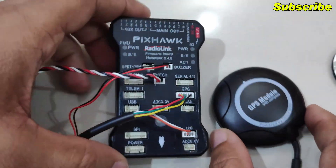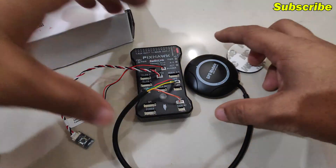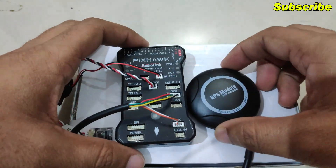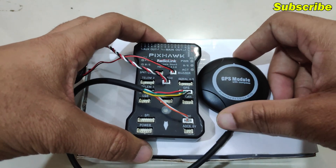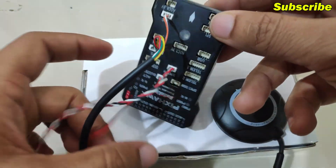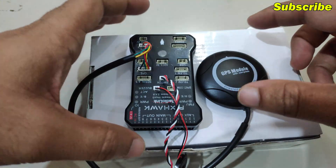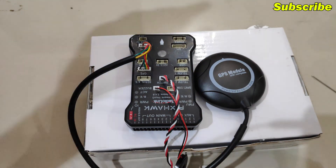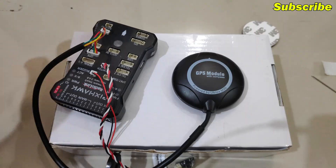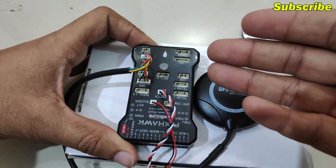Once this is connected, I'm going to use the box that came with the Pixhawk just to make the calibration process a bit easier. I'm going to stick this flight controller and the GPS module side by side so that they're aligned and the calibration can be easier, since once the GPS module is attached on the frame it's a bit of a hassle to calibrate the compass. I'll use double-sided tape and make sure that the orientation is followed, because on the Pixhawk we also have an arrow, so the GPS module has to be facing parallel to the flight controller.